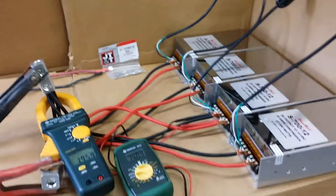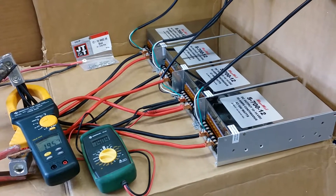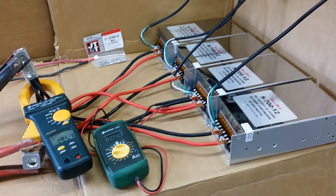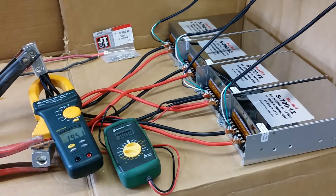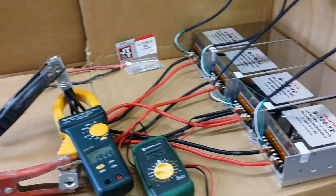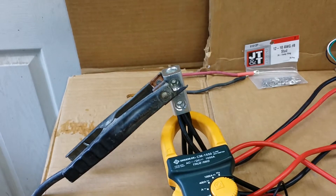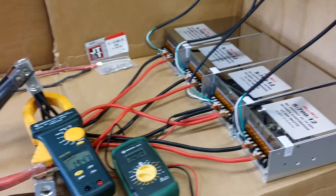Anyway, that's pretty much my little demonstration — don't want to bore you too much. Maybe some of the new guys can use some of this information, especially regarding wire sizing and distance. You can really control voltage drop by correctly hooking it up. I can see we're getting smoke off of the battery jumper cables — the number four — so we probably have to disconnect now. Thanks for watching the demonstration. This is John Marles from Megawatt Power Supplies.